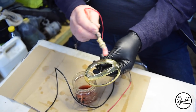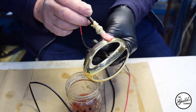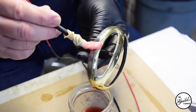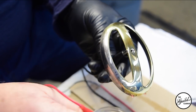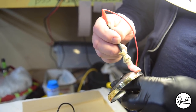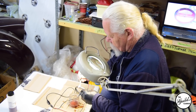Then I had to wash it for about an hour using detergent — I like to use Palmolive, but your mileage may vary. Cleanliness is the most important part of the whole process. As long as it's clean and there's no oil on it, the electroplating will stick. If there's the slightest bit of grease, fingerprint oil, or anything like that, nothing will stick.